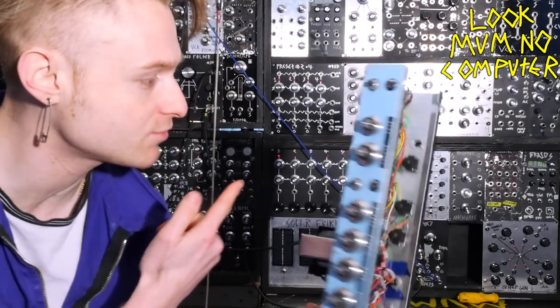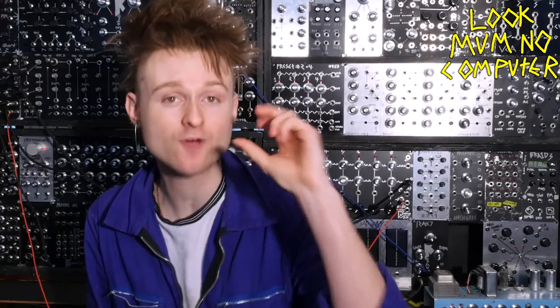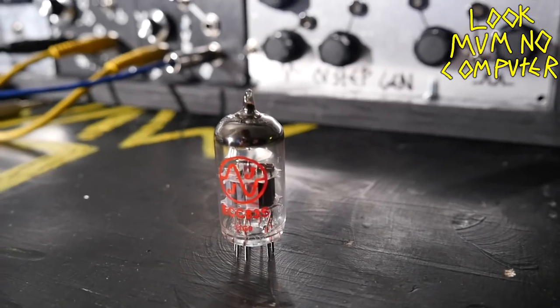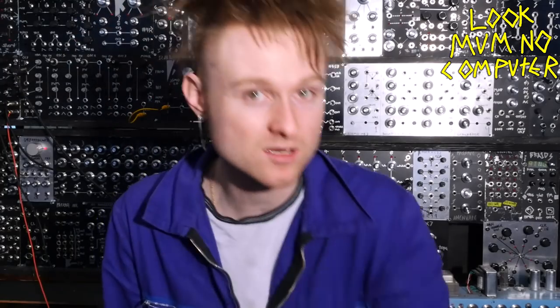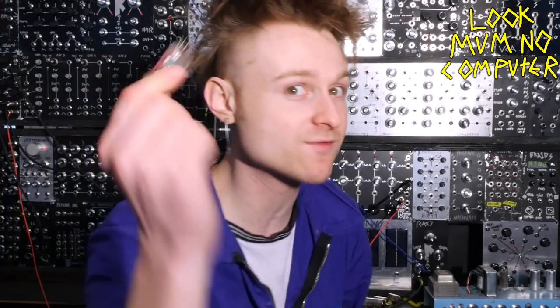Take valve guitar amps for instance — they just have a little bit more about them. In the DIY guitar pedal world there's a well-known low voltage valve overdrive design by a guy called Matt Suman called the Valve Caster. It's kind of like a saturating power boost using a 12AX7 dual triode valve, also known as an ECC83. The amazing thing is because it's low voltage it's underpowered, which makes it sort of frazzlier. The cool thing is the valve still glows because the actual glowing is from the heating filaments, and these even in a high voltage application are still only powered by six volts.